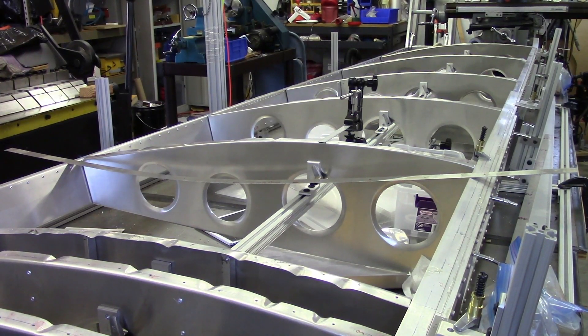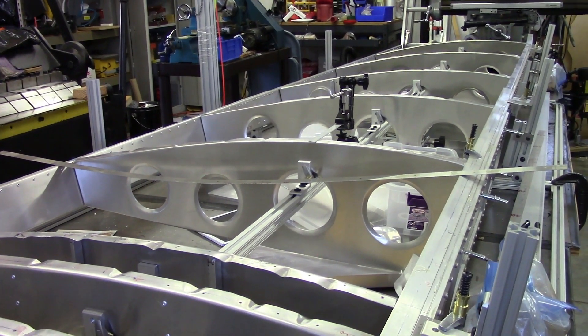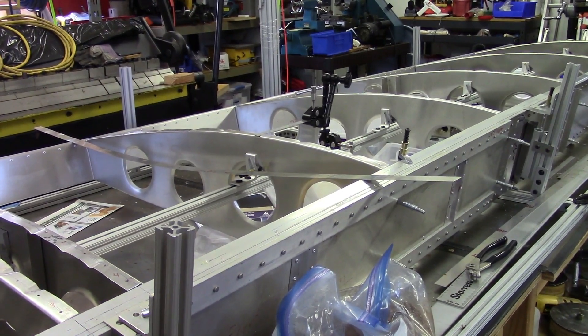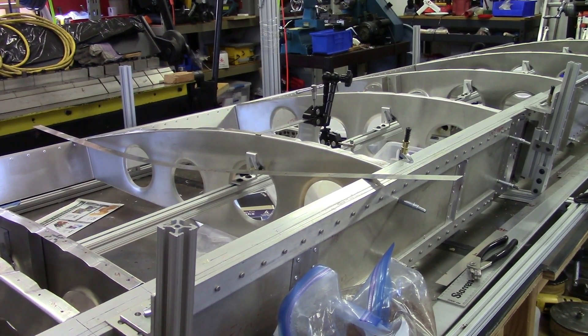This is all I'll currently cover as far as the attachment of the left wing skin. The next step on constructing this is I still haven't permanently riveted in the ribs to the spar and the rear channel, so that'll be the next step — hopefully fairly straightforward without any surprises since everything's already been drilled in. After that, I'll have to start thinking about being able to flip this wing over so I can get the bottom skin attached and riveted on.